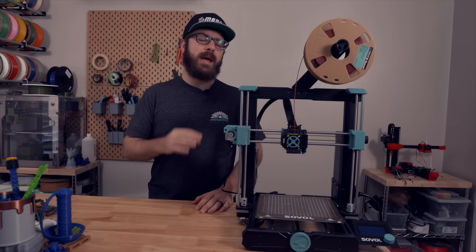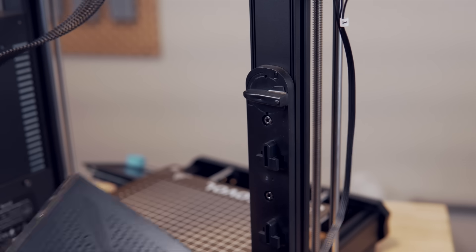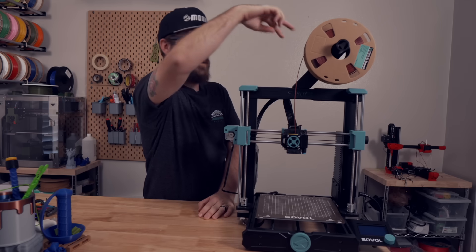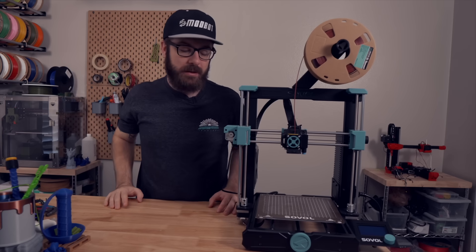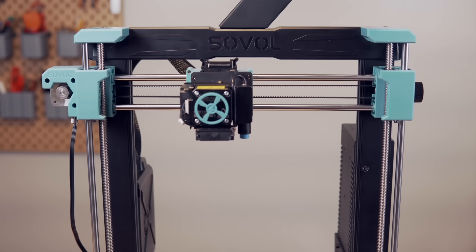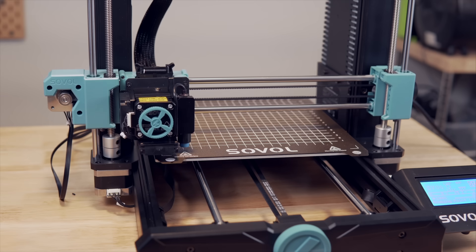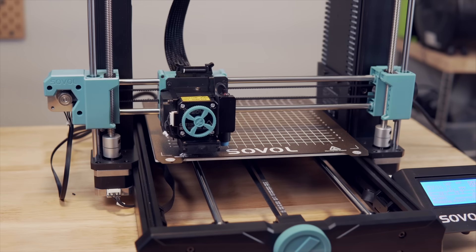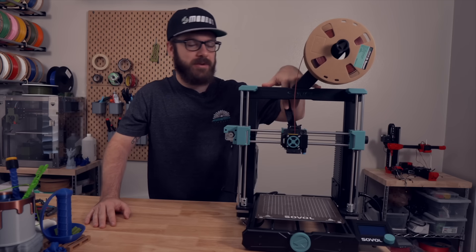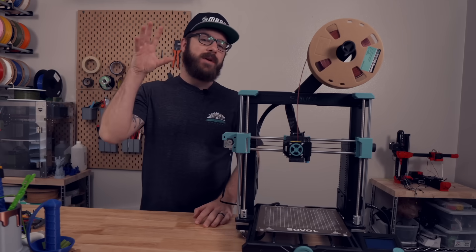The SV06 came packaged really nicely and setup was a breeze. You're basically attaching the top to the bottom, two screws for the power supply, the controller clicks in with a simple notch, two screws for the LCD screen, two for the filament holder, then plug in a couple of cables. You should be up and running within 30 minutes tops. Powering on, the setup has you run an auto Z-align which takes the gantry to the top, crashes it into the frame to align both Z sides, runs a mesh, and sets the Z offset — essentially the same method used on the MK3S Plus.